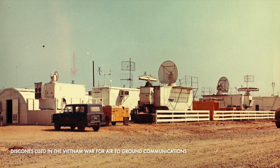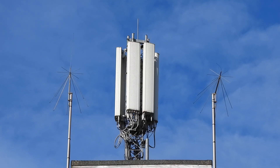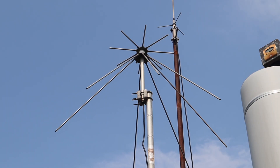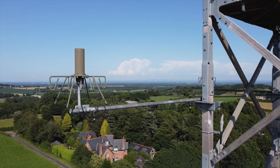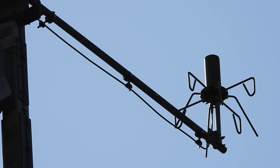Discone antennas are commonly used in radio communication systems such as radio scanning, military applications, public safety systems and everything in between. These two were used for testing car phone installations back in the early 1990s and survive to this day. This one is part of a former Ofcom remote monitoring station, and this one looks like a discone but actually isn't — it's a brass folded monopole enclosed in a fibreglass cylindrical radome, mounted on a skeleton ground plane made from four aluminium radial rods inclined downwards and four curved rods. These are found in aeronautical applications and are often confused with discones.